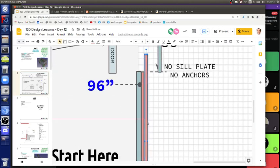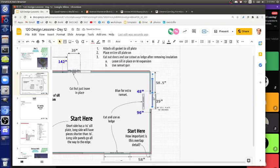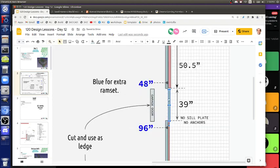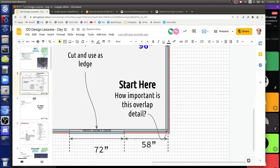So now the north part here. We zoom out a little bit. That insulation is on the outside. We're notching the insulation out only 3.5 inches down. It goes all the way 18 inches down, but we're just notching it out there, but it's hard to draw that. The board is what replaces that detail there. We put the board there on the side of the foundation, so the foundation is actually going out to like right there. Garage door sits on top. It sits on top of the board we just put there. So basically, when you step on the edge of the garage door, you don't bend it. You don't bend it stepping over the foundation. That's the idea there. Same applies to here, front double door.